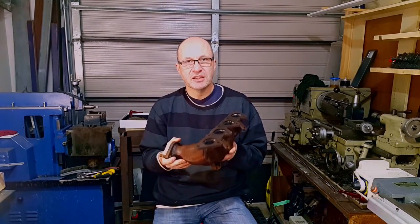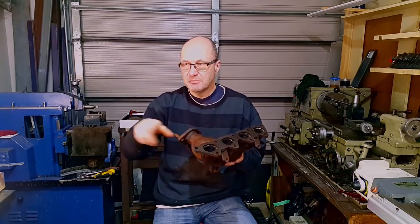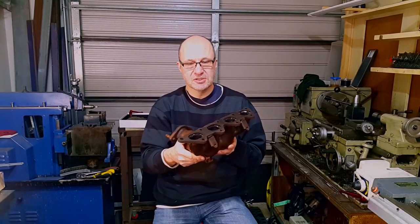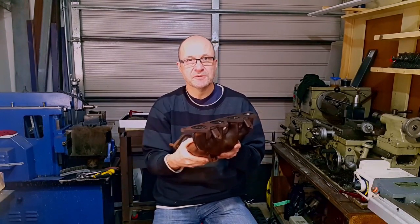I don't really want to go down the road of making a jig up because that's just not cost effective, so we'll have a look at mounting it on some pieces of steel, on two or three blocks, and see how we get on and hopefully we can get this mounted and machine this face for him.